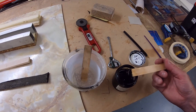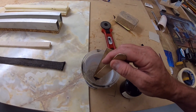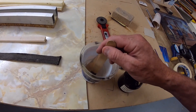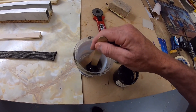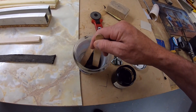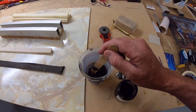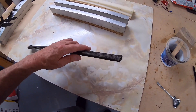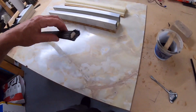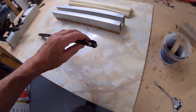A bit of colorant — doesn't need much. Because if you don't have colorant, you end up with clear patches in the layup due to voids. It's precise enough, and a little bit of color gets rid of any clear patches. With the sock, it's important to pull the sock ends to get the sock to constrict to the dimensions of the balsa inner.